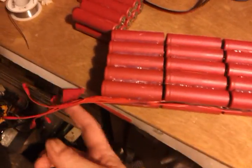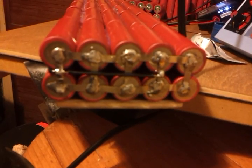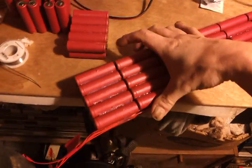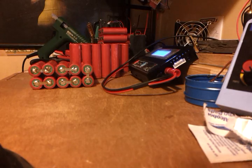This is the one I did earlier. Get all the balance leads down this side here — they're connected up at two points, coming in on one side and going across, stretched a little bit longer to spread them out. This is how everything's soldered up at the end — paralleled across in all directions. It's a big long thing but it'll run nicely down the bottom tube. All the balance leads come out the side, power leads on the other side. I've got a piece of timber on the back holding them together — it's 6mm ply, nice and rigid. Yeah, I know it's not fireproof, but by the time that thing's burning, so much else is going on anyway. Alright, take it easy — till next time.